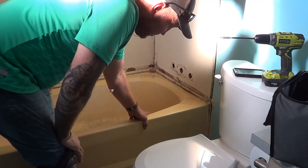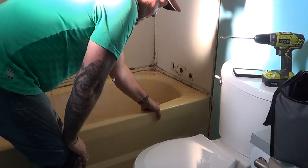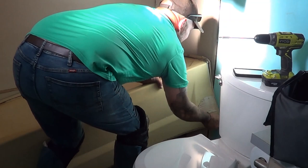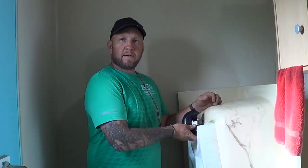What we're going to do is we're going to lift up on one side — I like to do the drain side first. I lift it up a little bit, get under there, get that little corner, lift it out a little bit. Lift the tub straight up like that, and then the tub is out.